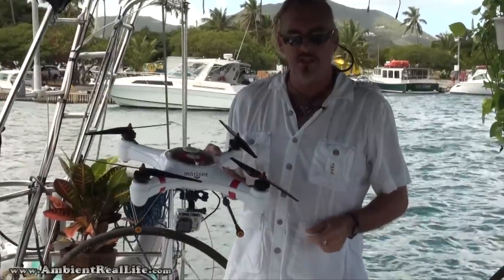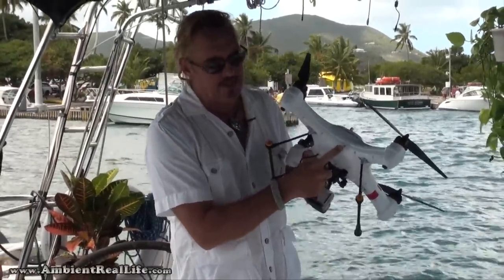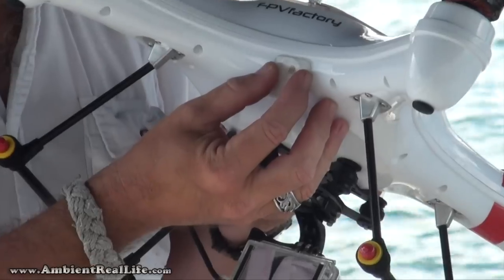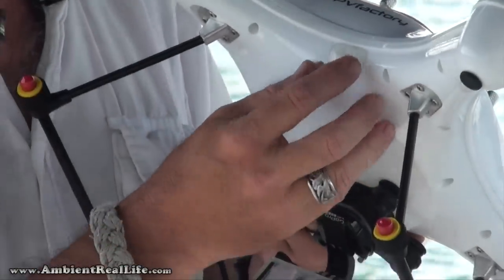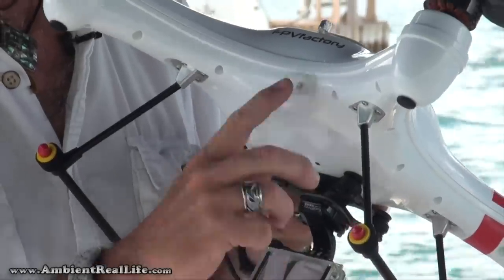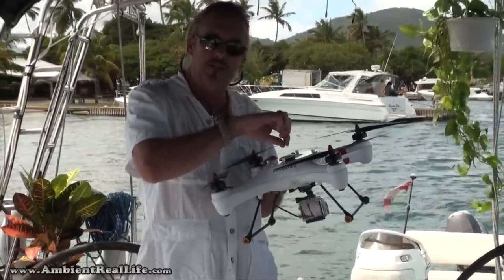Another thing we did that's nice to have is install a little LED light in the back. We've taken the main system LED and put a hole in the back of the Mariner. From one of my marine supply stores, I bought an LED lens, cut the lens off and physically glued it to the back with silicone. So it's completely sealed and waterproof. And then the stock system LED is just situated behind it with some adhesive tape.